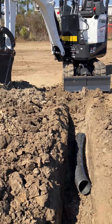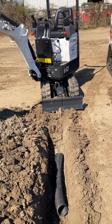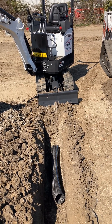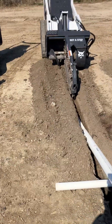You can also upgrade to about a 12-inch bucket. My experience with these machines is that 12 inches is about all you want if you're in hard soils. If you're in loose sandy soils, maybe you can go a little bigger. But those are two options you can use for both your drainage and your trenching.